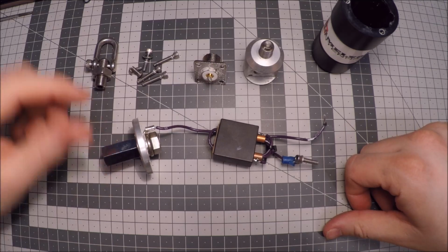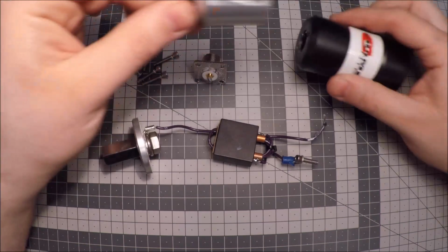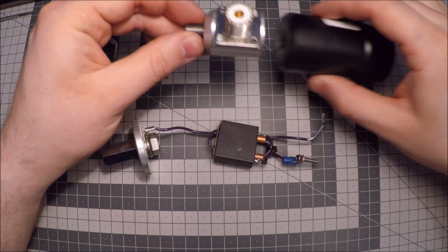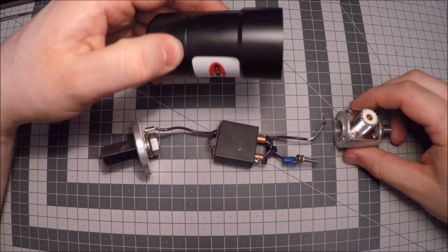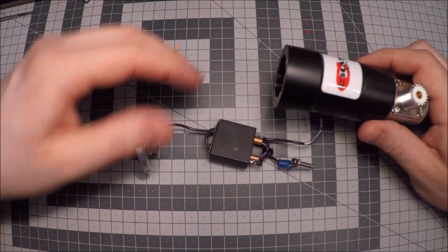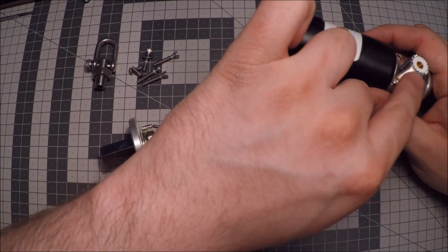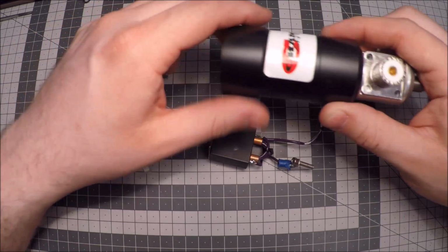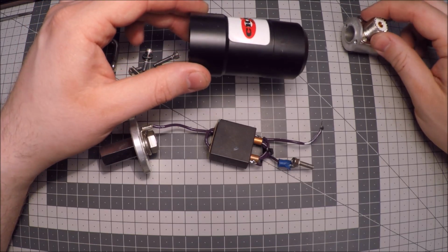Also, you could see here the aluminium parts. This is the bottom part, which goes on here, which is where the connector that you connect your coax cable to, like this, and it feeds this wire through here, so the body is like this with this hole, and this is mounted with this transformer tucked inside, and this screw goes to the chassis here, which is the shield, and this cable here goes to the center pin. And yeah, this works really nice.